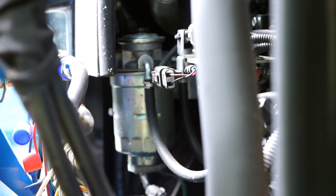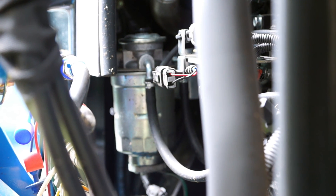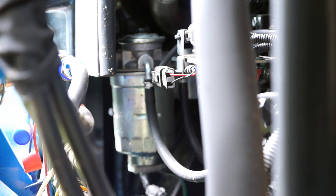Okay, so it starts. I'm assuming that's all set, and we'll watch the fuel and see if we keep getting that sensor to come on. That'll mean one of two things: if there's no water in the fuel, it might mean the sensor's bad and we'll let the dealer know and get a new one under warranty. Or if we see water, we might have to change our fuel supplier. But that's how you purge water out of the fuel system and reprime it on the LS XR series, specifically the XR 4040. Thanks for watching.